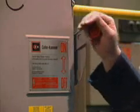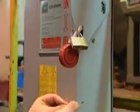Begin by disconnecting power to the motor. Next, lock and seal the power supply so the motor cannot be accidentally energized while you work on it. This is particularly applicable when the power source is located in another area. Red tagging is a good idea for these applications.